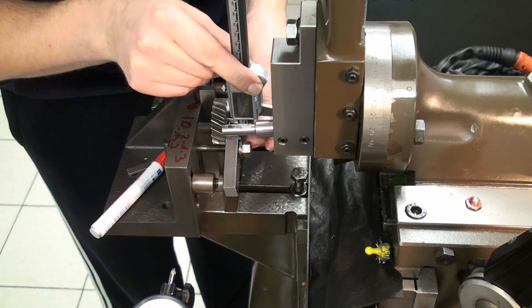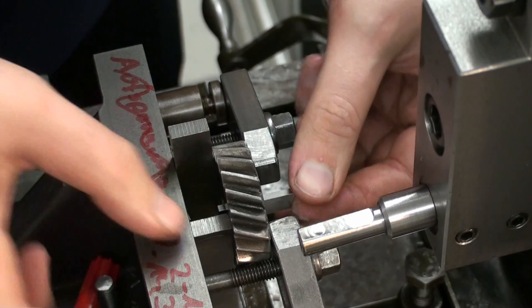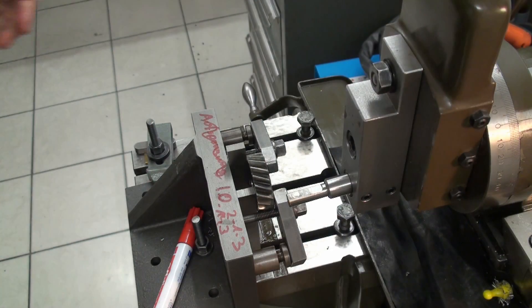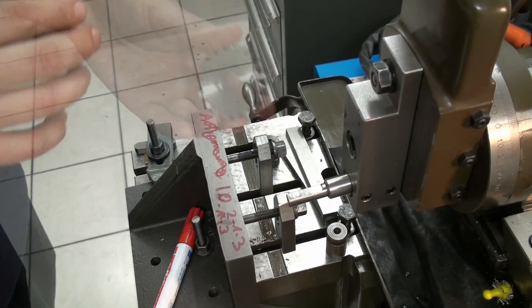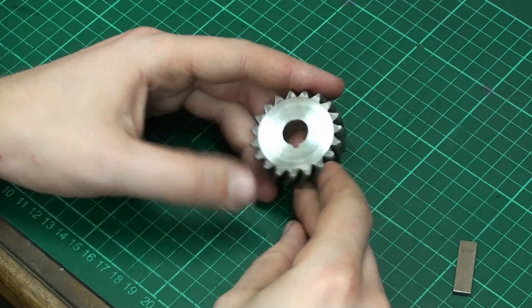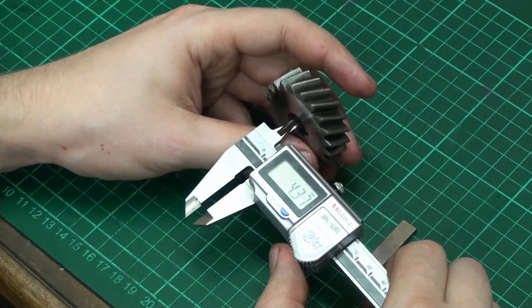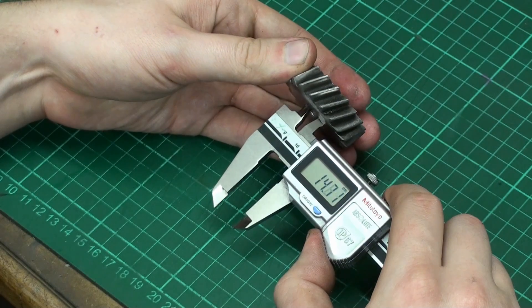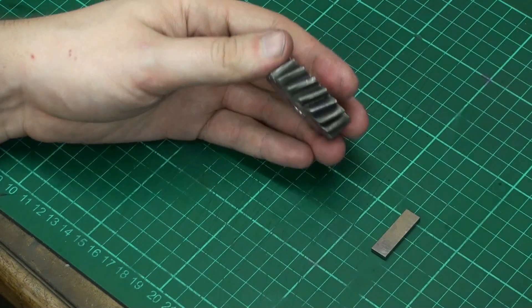I hit the 14.8 millimeters pretty good. I have a three millimeter gauge block here and that fits in my three millimeter keyway — perfectly snug, no wiggle at all. There you have it — one three millimeter keyway. We're back at the bench. The keyway is finished. A three millimeter gauge block fits into it very, very snug and very nice. The measurement we got from the person we did this for — the 14.8 millimeters — we hit that pretty good. Hope you enjoyed, thank you for watching.